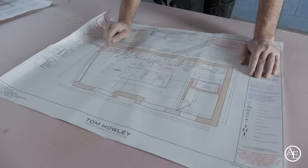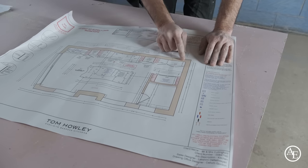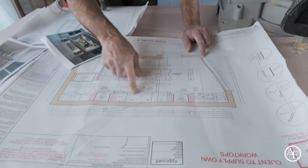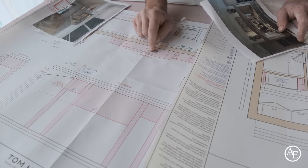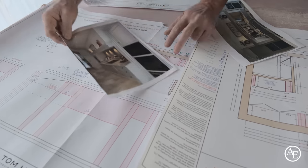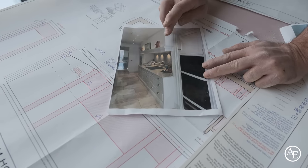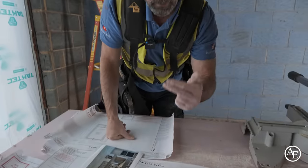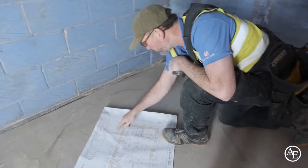So that's our line. All we've got to do then is mark the front of these studs where they're going to go. We then plumb these up, do the relevant measurements from finished plaster to finished plaster. You can see on the drawings the line of the units comes all the way through here, but because of this soffit detail, we've just noticed the soffit has got to come through, because you've got the extractor hood, which comes past this 600 line. When you look at the drawing, you can see the soffit line underneath, which is going to carry the extractor. We've got to make sure it comes through. This is a detail which the cornice then goes on, but this has obviously got to protrude. We need to make sure we build the soffit all the way through, ready for the extractor to go in as well. So that first measurement, I'm going to do 1777.